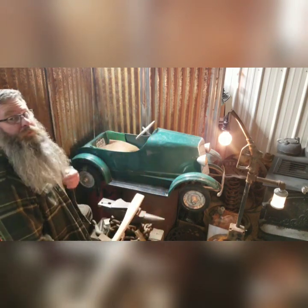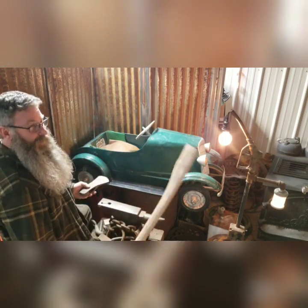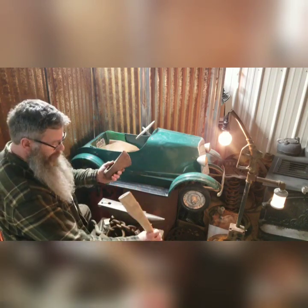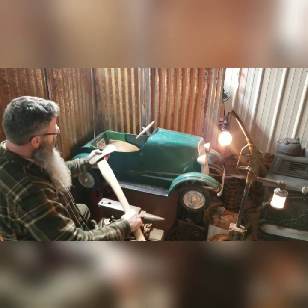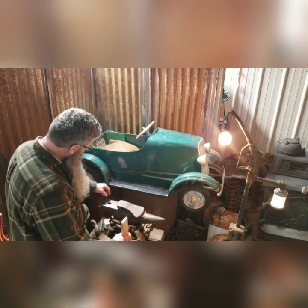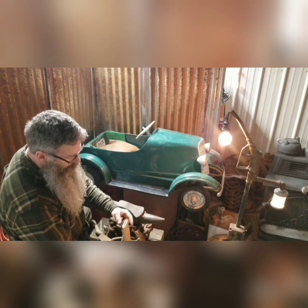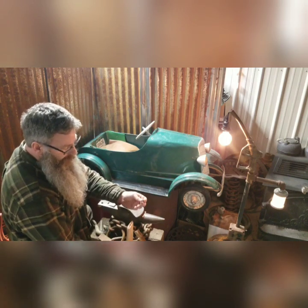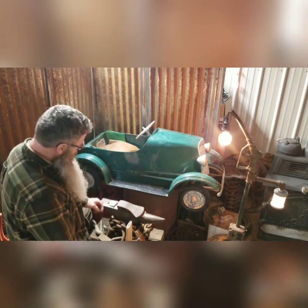The handle comes in three or four parts. Make sure you put it on correctly. There is a teardrop effect on both the head and the handle, and also the end of the handle — that's your swell to keep it from sliding out of your hand. You want that facing forward. You've got the handle itself, you've got a wood wedge that goes in there to swell it up to fit tightly in the head, and then to keep that in there you've got a steel wedge or two that you put in at a diagonal and pound in, which locks all the pieces together.